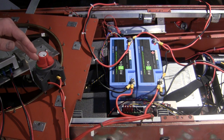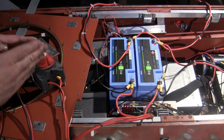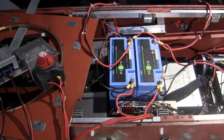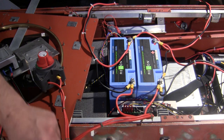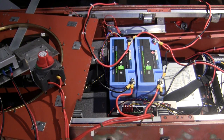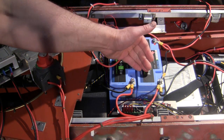Rather than going ahead and keeping it the way it was, this gave me the opportunity to add the perfect location to cut the power in half. With the way this is hooked up now, I simply changed one of the leads so that, instead of going to the main power, it now acts as the jumper cable that connects the two batteries together.